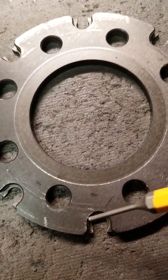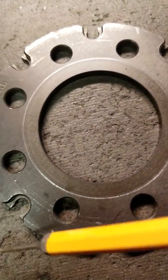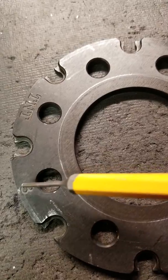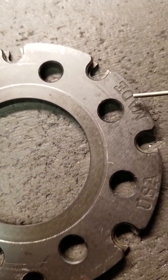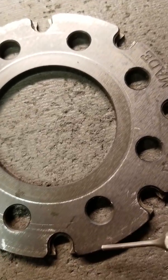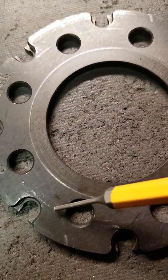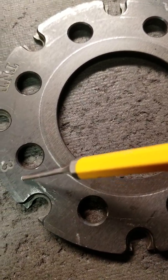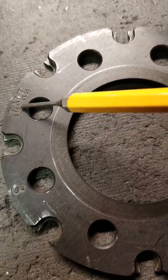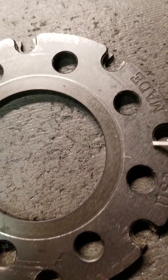So the first thing we do is inspect the plate and see what's going on, check the pockets, make sure that's okay. Notice this regular mark on the plate that we don't normally see. It happens to align perfectly with an ejector, and you can see the scraping because the ejector is set dragging the plate instead of sitting above it, which of course would cause some issues in there, and you can see it all the way around the perimeter.